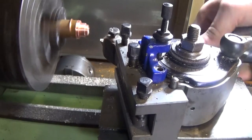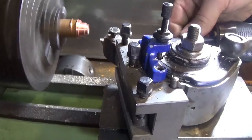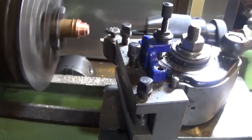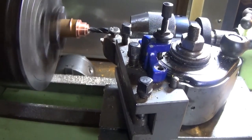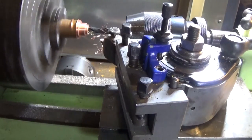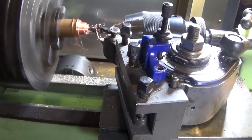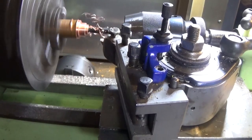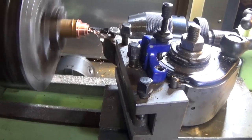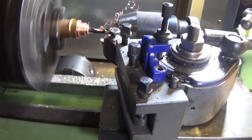Run a centre drill in it. Now I've got this drill which is 7.2mm - the correct size is a letter K and I don't have a set of letter drills, which would be useful, but that'll happen one day. It's a brand new drill but even that's struggling a bit with this material. It's pretty hard to machine and not much fun. Probably a bit of coolant would be the best thing, but it's stinky and not that nice, so I'll try to live without it.